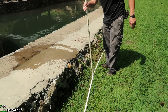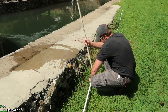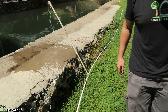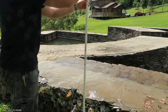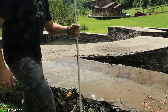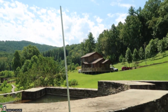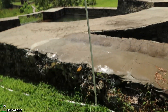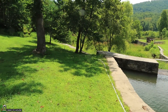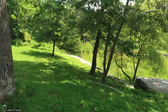Yeah, a little bit short. Water is still coming out the top here. Have to find a longer piece. I just got a piece of pipe that's about three feet long. I'm going to stick it on top of this one so that it doesn't have that leak anymore. And then to keep this upright, I've just got some twine. That stand pipe right there raises about a foot above the source and gives us about 40 to 60 less feet of drive pipe, which should be a significant boost to our pump here.